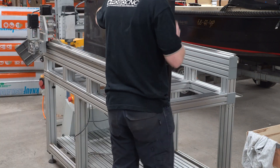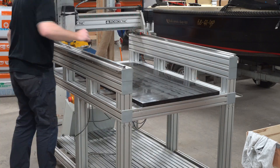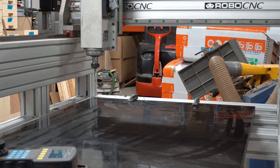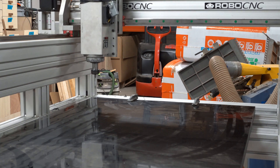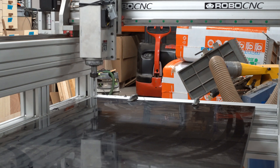The PVC is flattened, the mounting holes are drilled — it's time for the spoil board. I chose a 25mm thick HDPE high density polyethylene spoil board, and it's time to drill some mounting holes in the same known locations.